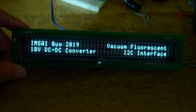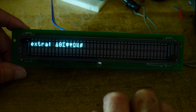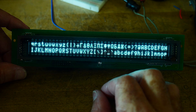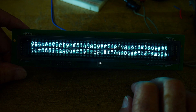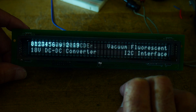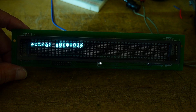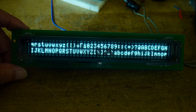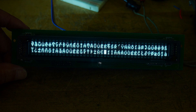There we go — it's a beautiful display, really really nice. It has a bunch of special characters. I'll run through the character set here: regular character set and a lot of Russian Cyrillic characters up here. I'm not quite sure what all these special characters are used for, but I picked out a few that I thought were useful and they're here on the next display. I figure I could use those sometime or another. It's current hungry — it's operating at about 730 milliamps at 5 volts.